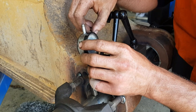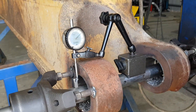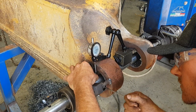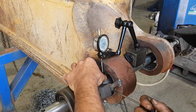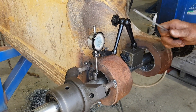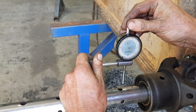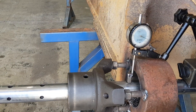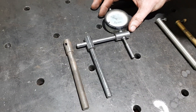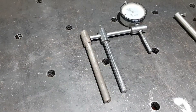So we've measured the bore and we're going to use a dial gauge now to advance the tool — very important to get this right. And it's that easy to advance your tool. This isn't the general way we would do it — we do have a proper tool that fits in the bar with a post that comes over the top to touch down on top of the tool. At the moment we're a little bit tight for clearance so we can't use it, so sometimes you've got to go back to just a standard mag-based dial indicator.